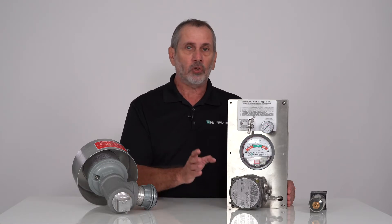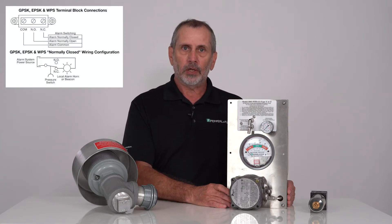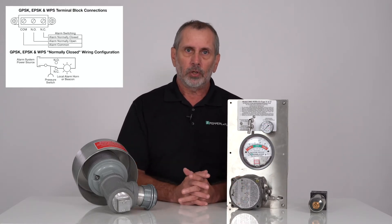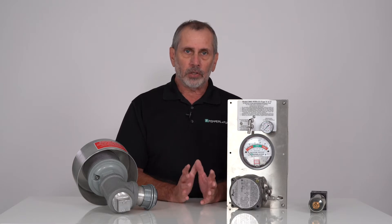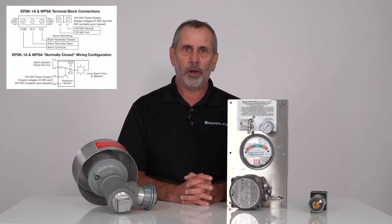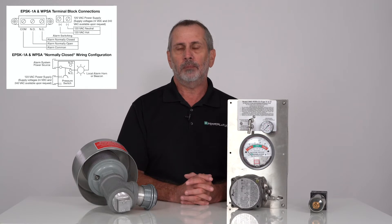The differences between the WPS and the WPSA is the wiring. As you can see on this diagram, on the left is the WPS option, which is a dry contact output on the pressure switch. The pressure switch has a normally open and normally closed contact, and when you get below a certain pressure which is unsafe, it energizes and sounds your alarm — very simple. The WPSA has the same switch with a normally open and normally closed contact; however, you have to apply power to the WPSA to get the dry contact output.